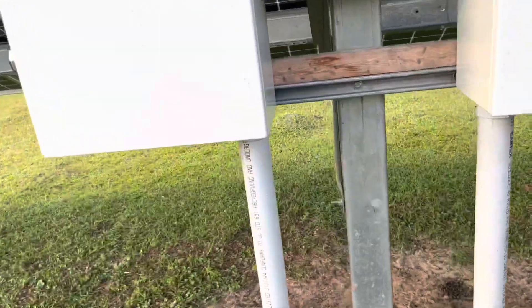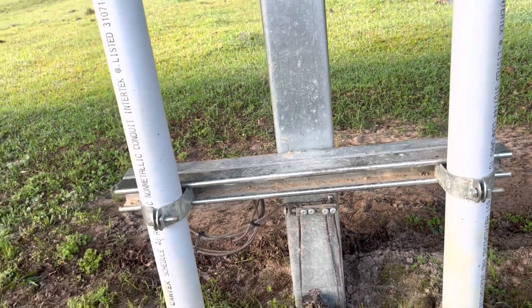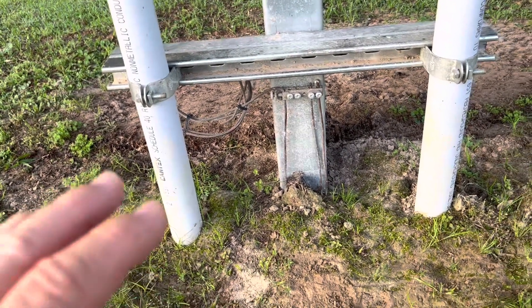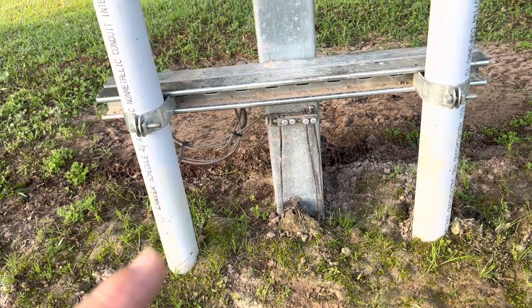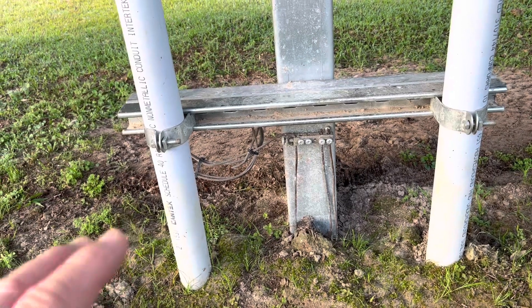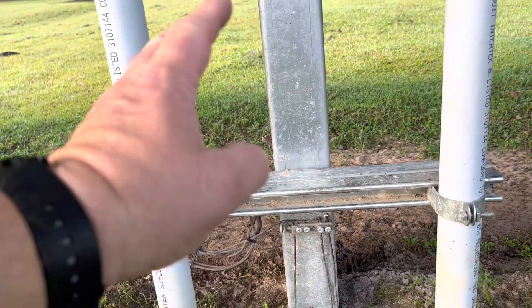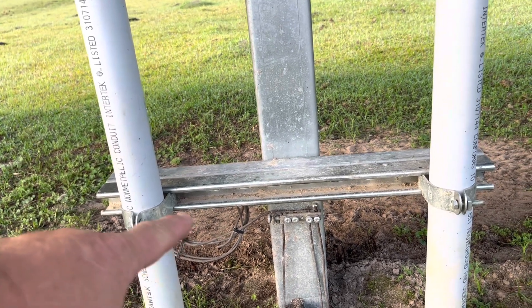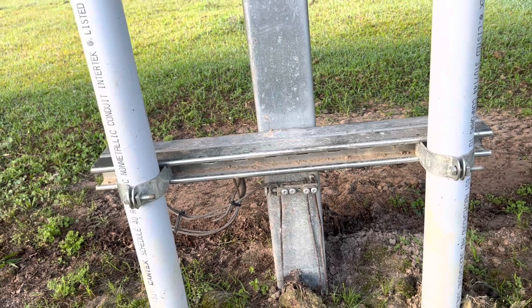You're burying bare copper in the ground because what you're trying to do is connect this steel to the ground — and by ground we're talking about the dirt. These other two bare coppers just go up in the ground and come up this conduit, which stubs into the ground about 18 inches. My PV circuits are direct burial, so there's no conduit that runs all the way to my power building. It's direct burial, as I showed in an earlier video. So this is all bonded together — five posts driven in the ground, tied into that number six bare copper running all the way back to my power shed, which connects with my utility grounding system.